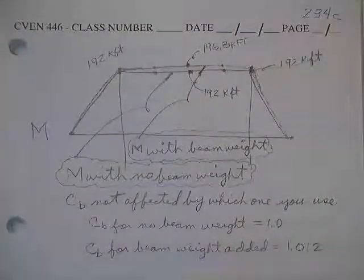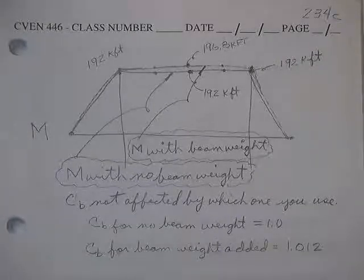On the last problem we were working, we added the weight of the beam almost as an afterthought. I forget how many kips of load it was carrying — four or five kips per foot. The weight of the beam was only about another 30 pounds per foot. It couldn't hardly make a difference, though sometimes it can — just the tiniest bit. If you've got a really good, efficient beam that you haven't included the weight for yet, it's possible it'll put you over the limit and make you move on.